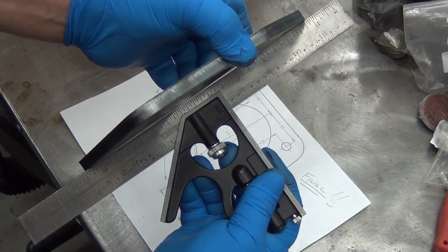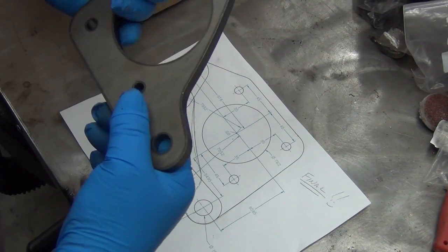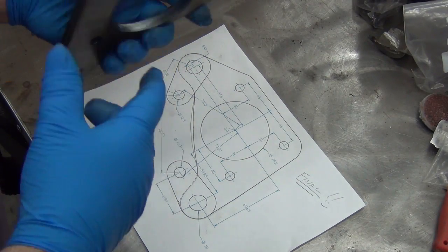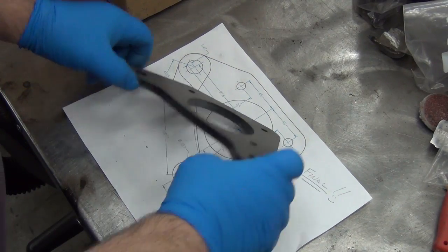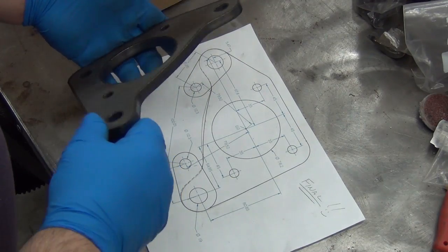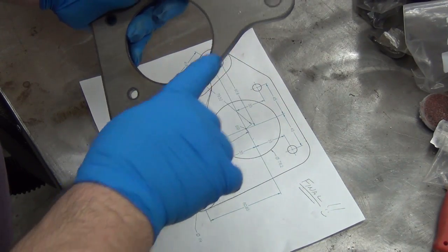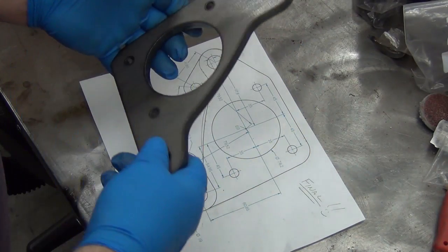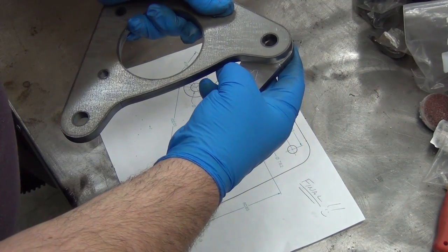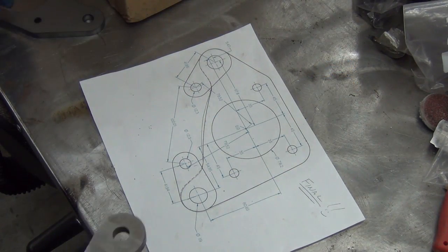You can see extra heat on the exit side. If you put it on this side it rocks, which is why when I put them together I end up machining the tabs so they're flat. Since they were all cut one way, there's no left or right - you just flip them over. That means this one's folded away a little bit and this one's folded up a little bit. I've got to bolt it down and see how flat it is once bolted down. There are only three bolts holding it and the bend is over here, so if the tabs are on this side and I machine them flat at the right depth, that'll be fine because it'll match up.